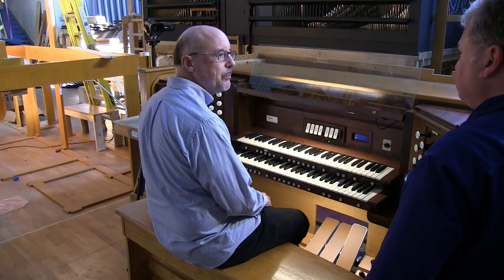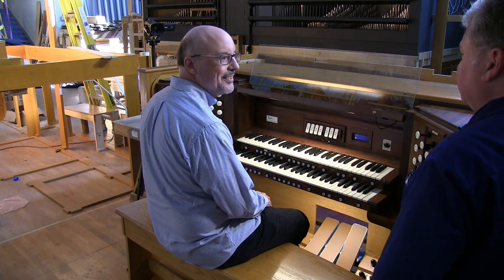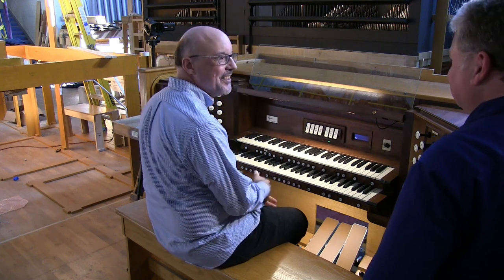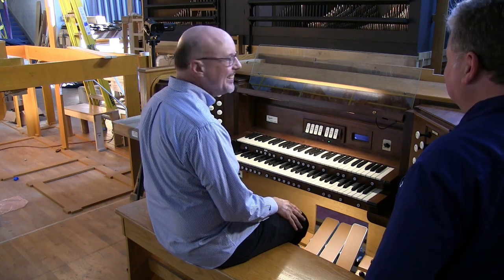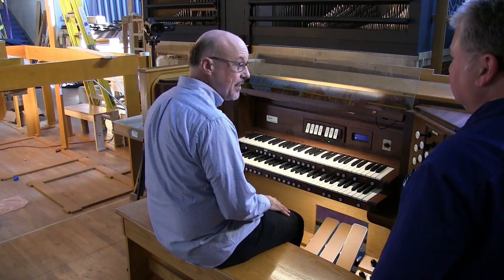We don't have every single pipe in the organ yet. We're still in the process. When we put up instruments in the assembly room, we generally don't put the reeds in. They're brought in to be racked, and then they go right back in their plastic bags so they don't get dusty, because even with our very good air handling system and dust collectors, you still get some dust in there. So the reeds are never in unless it's a special.